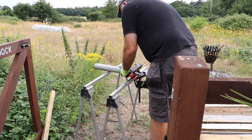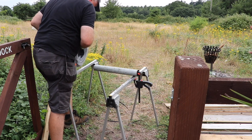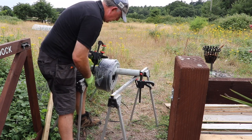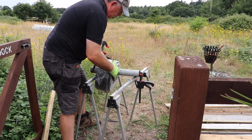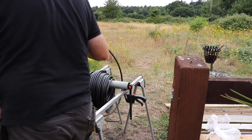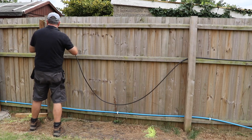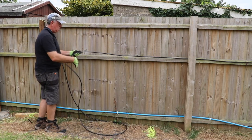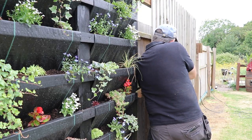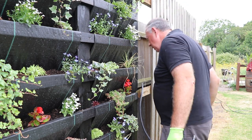With the water pipe fixed in place, I turn my attention to the armoured electric cable and spend a few minutes rigging up a stand so that the cable can be unwound. From experience, this makes it a lot easier to pull out rather than just laying it on the floor — you avoid putting twists in it, which can be a nightmare for a cable of this thickness. As the installation from my consumer unit to the paddock is notifiable under Part P of the electrical regulations, I can't complete the wiring myself. However, I can get the cable in place so when my electrician friend comes to complete the job, the cable is already there and he can test it and complete the connection.